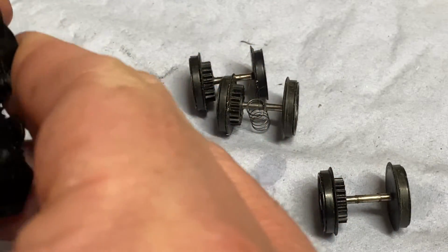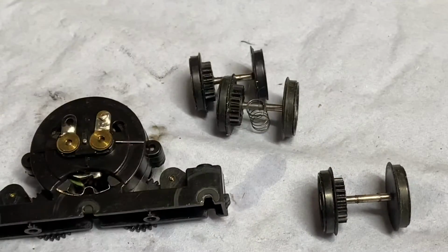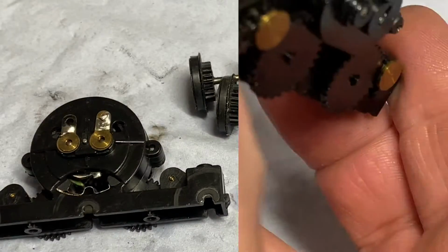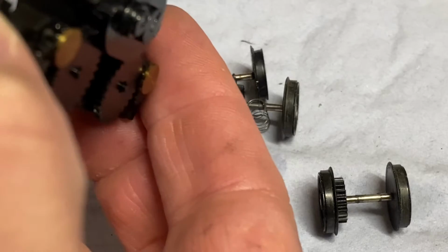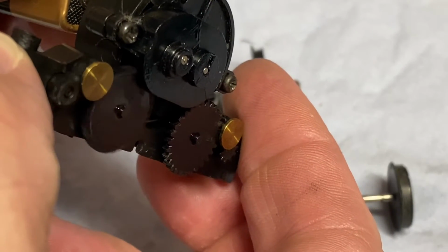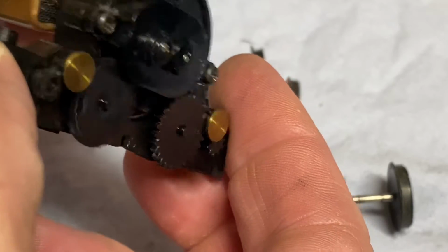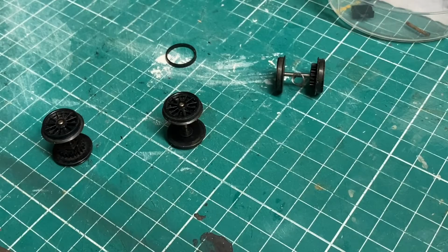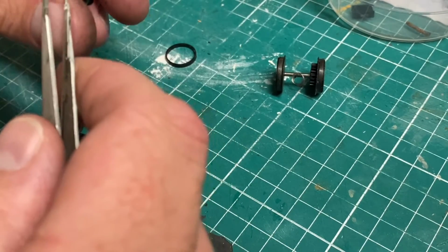The motor is reassembled with new brushes and has been completely cleaned from the top to the bottom. Now we give the motor a quick test with the battery and voila! A fully serviced and rebuilt motor that is running like a Swiss watch. The crack in the motor frame appeared to be just on the outside and not on the inside, so hopefully it will last a good few years in service.